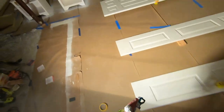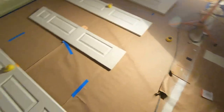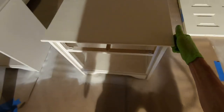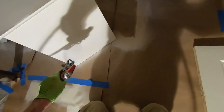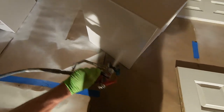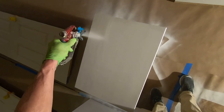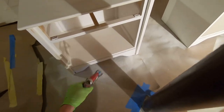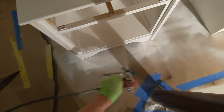I'm going to go ahead while I've got my small tip in and finish some of this furniture. We'll go inside here just a little bit. Front, sides. Now each pass, I want a half overlap. Here's the edge of my spray — I want the middle of the gun there, so we half overlap each pass. And now the top. I'm going to slow down a little bit and put a little heavier coat on this top. You see my half overlap. Mainly just showing the technique. We'll second coat these after a while, hitting the insides and sides.